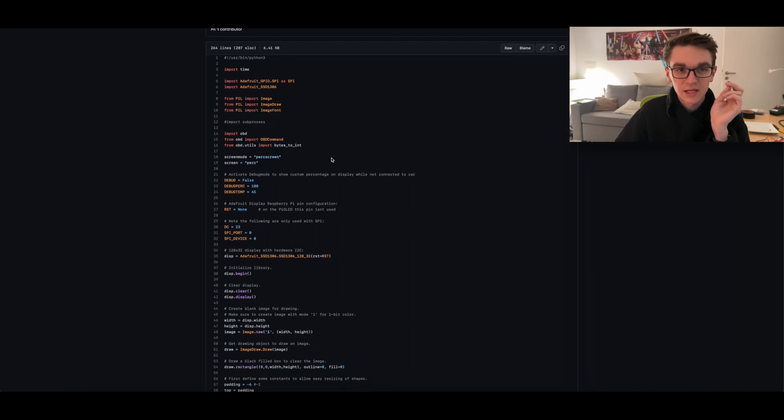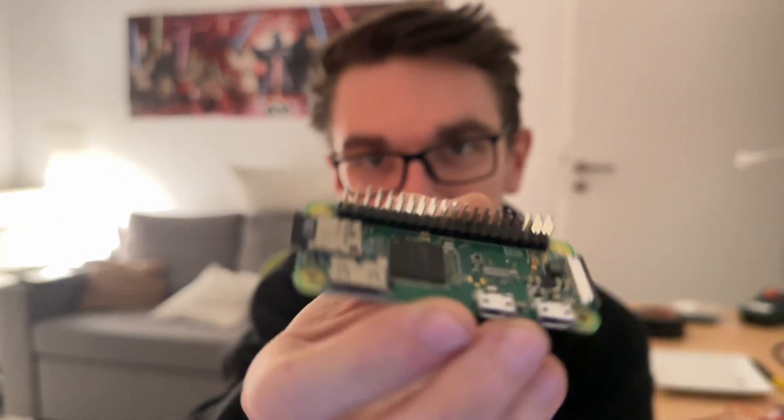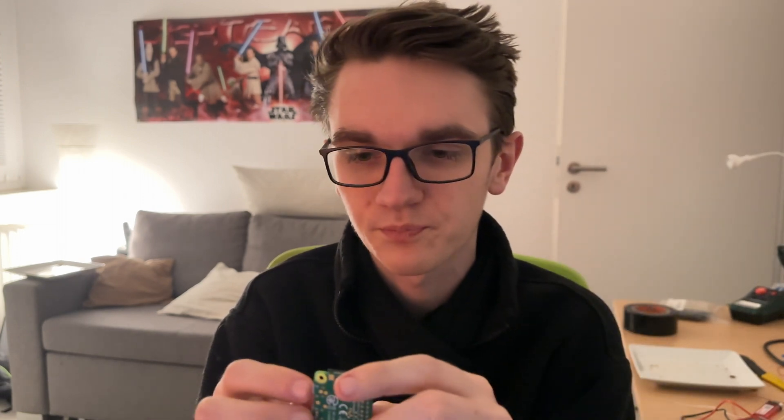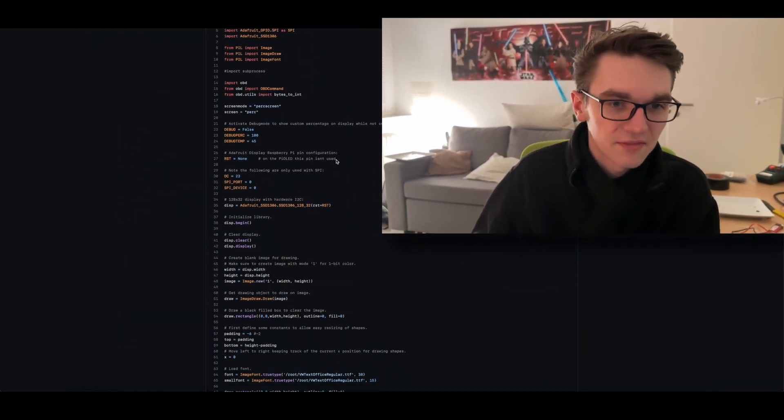What's important is I'm using a Raspberry Pi Zero — I've got one lying around here. It's just this little single-piece mini computer, powered by a micro USB port which gets its power from my car via the USB or the 12-volt cigarette lighter plug. To it I attached a USB OTG cable — it's a cable that has a micro USB on one side and a normal USB-A female plug on the other side. This gets connected to the Pi, and on that side there's a USB-to-OBD dongle which connects the Pi to the diagnostic port of my car.